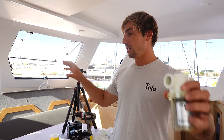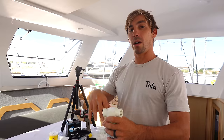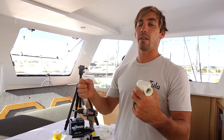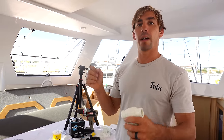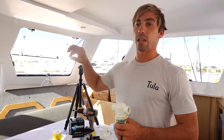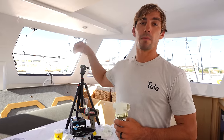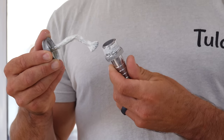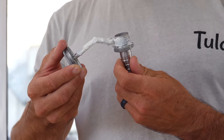So it's not like these two systems will ever draw out of the same through hole at the same time, and they'll each have their own ball valve on either side of it, and probably a check valve as well, so there's no chance of either one pulling air from the other system or pulling water from the other system. Using thread sealant and just screwing together all the intake components, I mocked it up in its space.